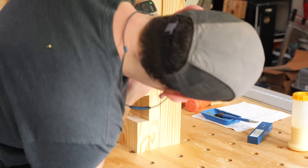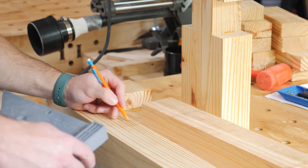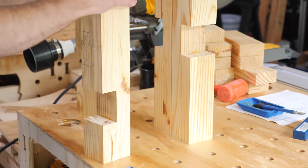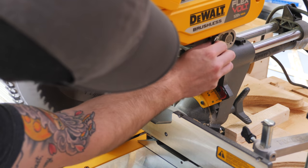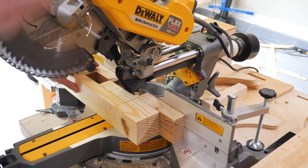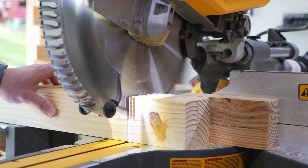As I mentioned, I did actually need to cut a few half-laps — exactly one in each leg — so next I laid out the location for those cuts. I referenced the other legs for this measurement rather than trying to use a tape measure, and this just ensured that my stretchers ended up square to the legs. I was originally going to cut these half-laps on my table saw, but my dado cartridge for the saw stop is at my main shop, so I figured I'd try a new technique and cut the half-laps on my miter saw. To do this, I set the built-in depth stop on this sliding miter saw equal to the thickness of my stretcher pieces — most sliding miter saws have this kind of depth stop feature — and this actually worked better than I expected. To cut across the entire face of the legs, I needed to space them off of the fence, which I accomplished by adding a few scraps between the face and the legs, and then it was just a matter of cutting to my lines and clearing out the waste.